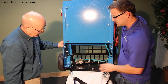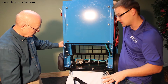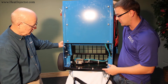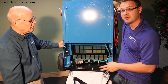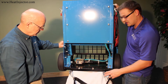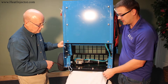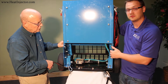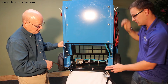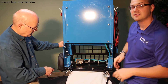There's this connection here — this is the bottom hands-free connection that interfaces between the base module and the blower module. Through this connection, we are transmitting all the electrical power for the motor and the high temp limit, the pneumatics for the HP boost and the main airflow blower, as well as the thermocouple for the discharge temperature sensor. You also see these pegs that stick out — these are dual purpose, acting as a kickstand and an alignment tool that connects the base with the blower. Once they fully insert into the blower module, there are pull pins that you insert, with another one a little higher, making that connection very sturdy.